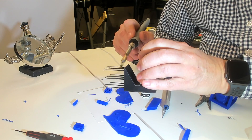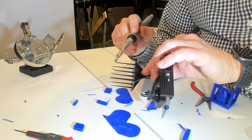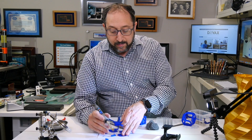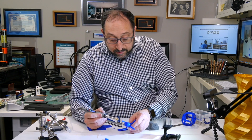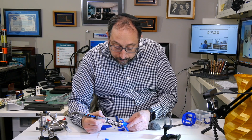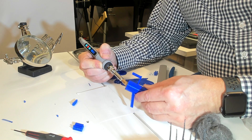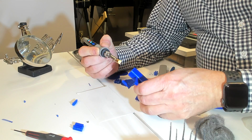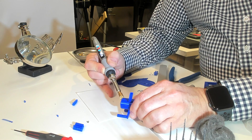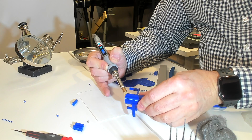This is really the best possible way to clean up an object. I've replaced the knife blade with a flat end tip. Once it's up to temperature, I can use that to iron surfaces and smooth out a surface completely — or in essence reshape a surface. So if I wanted to add a bevel on the edge, I could add a bevel on the edge here, because in essence I'm melting or ironing this plastic.